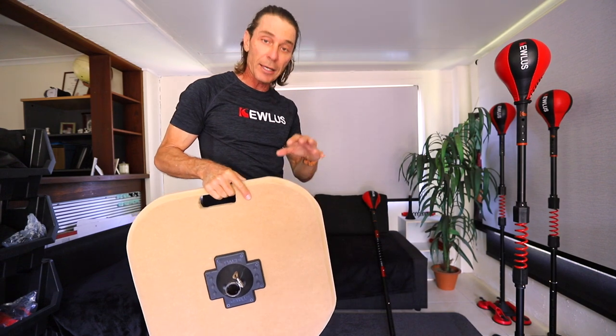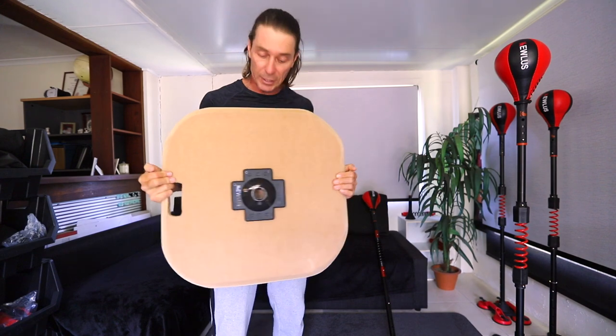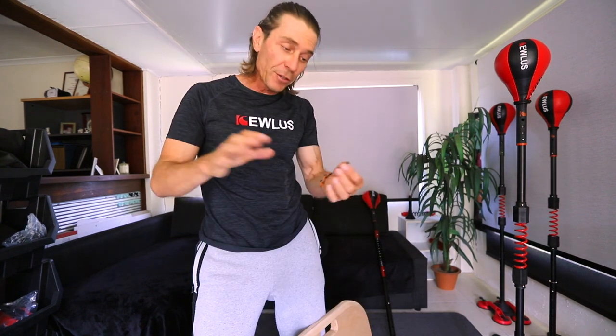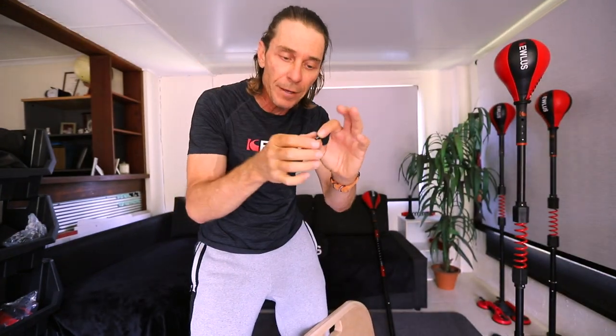This one is actually one and a half inches where I've used two boards stuck together. Now if you're not able to make these boards yourself or buy them at a hardware store, you can get a cabinet maker or a carpenter to make this up for you. For the screws I'm using one and a half inch wood screws with a countersunk top, and these are perfect — you're going to need eight of these.